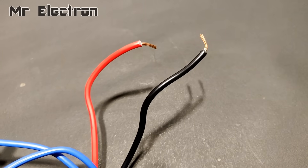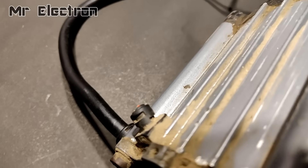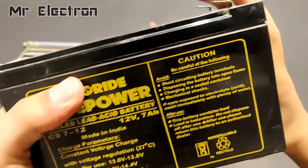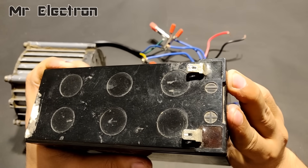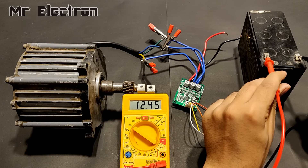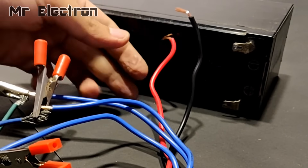The batteries have still not been connected. You can see that I have given enough space to prevent any short circuit. There is another slot on the BLDC motor coming out from the hall sensors inside, although they are not required for this circuit. This is a 12V 7Ah UPS battery I am going to use. Let's measure its voltage first. The meter is showing 12.45V, which is enough to run this BLDC motor. Remember, this circuit is rated at 12 to 36V and 20A, so I cannot connect batteries more than 36V. Positive will be connected to the red and black to the negative.